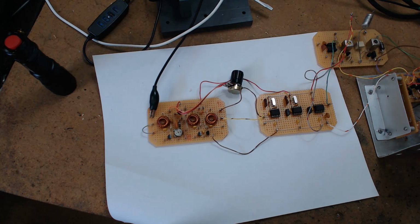So I wrote it up. It's on the internet somewhere. It's the tone control capacitor. You can go in and you can disconnect it at one of the connectors. You don't have to desolder or anything. And I did a video on that. That's gone. That's one of those deleted videos. I started getting hit with people that wanted me to fix their radio. And I don't want to fix radios anymore. I like to build them.